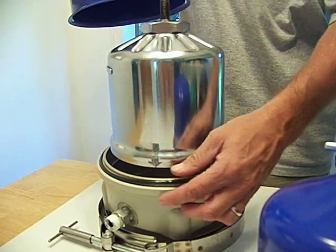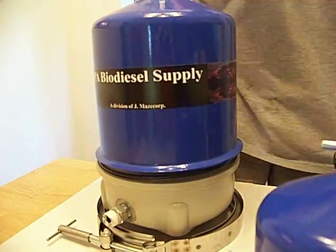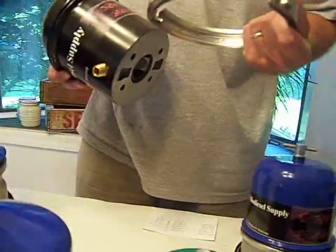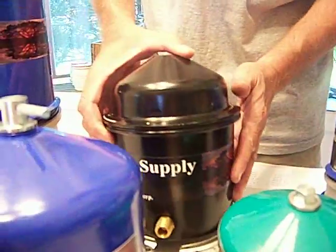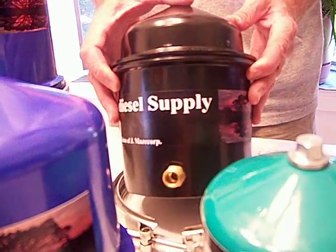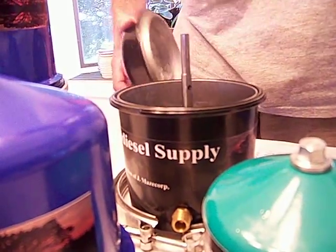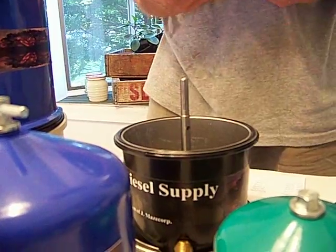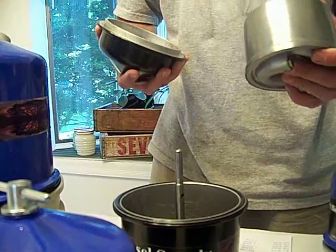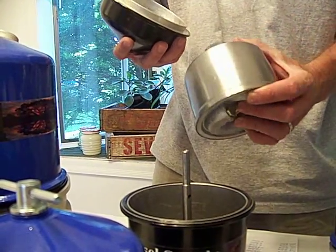I don't really know that this is one for the guy in the garage. Next, we come to our 240 model. All the bigger ones have these lock braces that go around them — not only are they bolted down, but then the clamp clamps them. This one is 240 gallons per hour, 4 gallons per minute. This and the 300 both take a 1 horsepower motor. This rotor is capable of holding 44 ounces of contaminants.